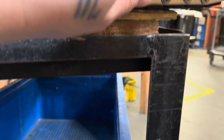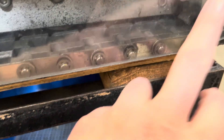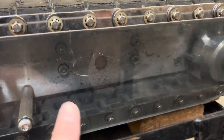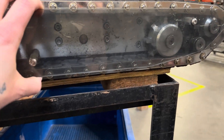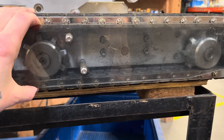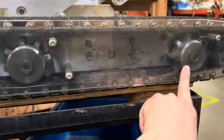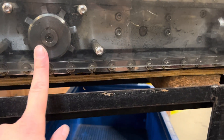Eventually, over time, if you can see these sprockets here that go inside the grooving of the track, there are holes made for our sprocket. Eventually, over time, these sprockets aren't going to be able to grab the track, which will result in a lot of slipping. When you're towing your plane, you'll wonder why your tug is just randomly acting this way all of a sudden. There will be some slipping, and then these will also start grinding down, which means you'll have to go in and replace them.